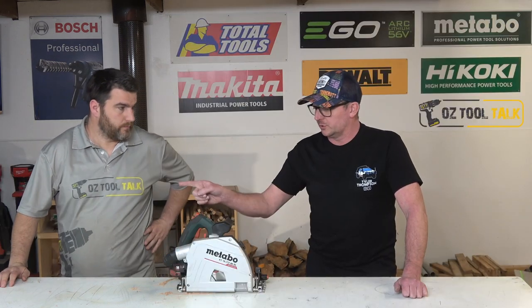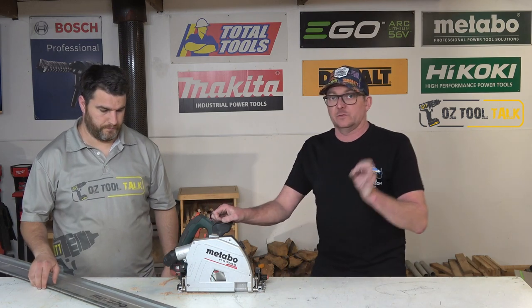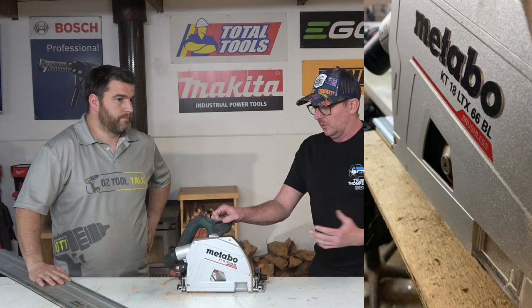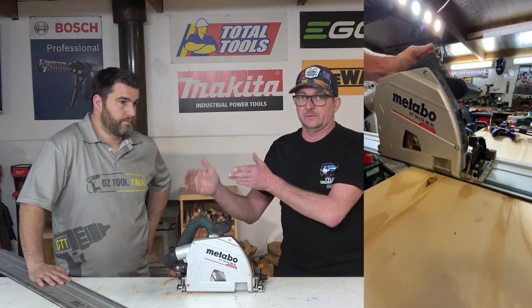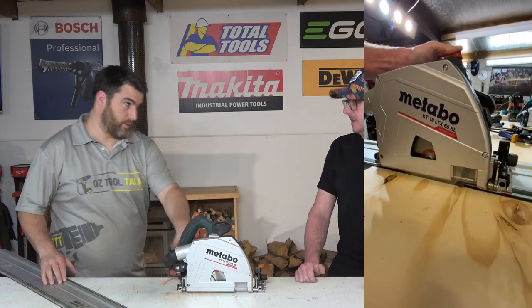Just to interject: just because the battery says 10 amp hour, bigger is not necessarily always better — it's a bigger fuel tank, but the whole battery chemistry and what cells are inside matters. If you're only cutting 3mm Luan ply or an aluminium composite finishing panel, you might want to run the 10 amp because you're not needing all that grunt. But understand the 5.5 is the most powerful. If you're plunging into hardwood, that's what you want.